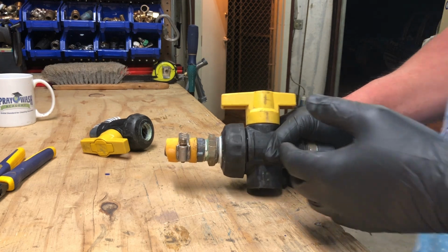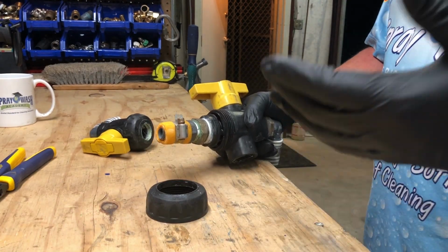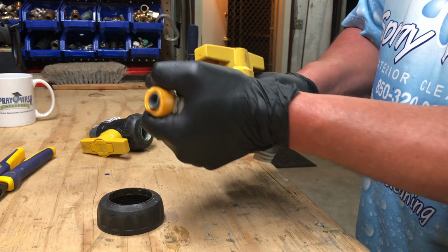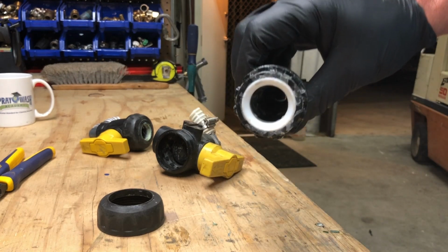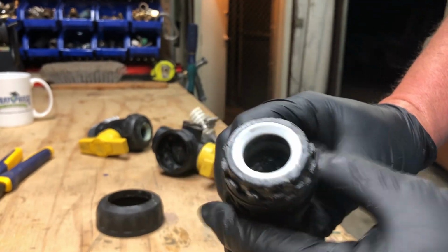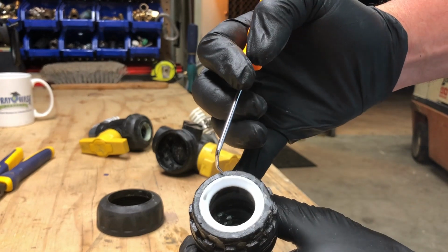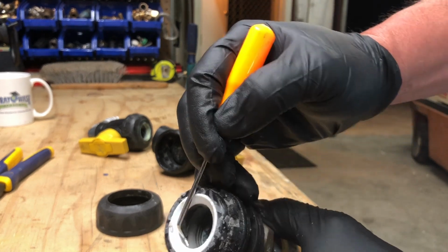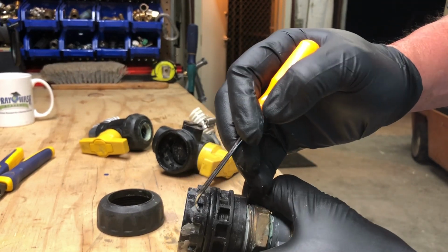And I want to show you something that we call sodium dropout. If you work with bleaching, I don't care if you're working with a 12 volt, a booster pump, an air pump, something like that, this is one of the things that will happen to a lot of your valves. Everything gets a nice fine coating of sodium flakes. Let me see if I can bring that to the camera, if you can see that in the light. You can actually see these crystals along in here. Same thing that happens on our diffuser plates in our booster pumps. Take it off with a light muriatic acid rinse.